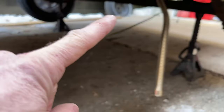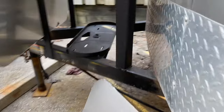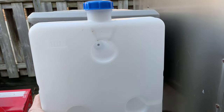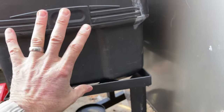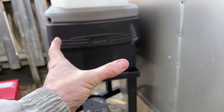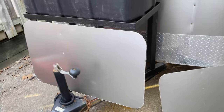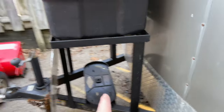Here's my temporary tank — I was running my hard line in underneath. What I'm going to do is run a garden hose for that fuel line all the way to the front and up to the tank, which I'm going to mount on the outside. I'll make a couple of L-brackets bolted on the bottom to carry the weight and also bolt it to the hard box. I've got some aluminum from my window opening to build a little guard around the tank for protection when driving through the bush. The other window opening I'll use to cover my propane tanks — just bend it, cut it off, and you can still load the tanks through the side.